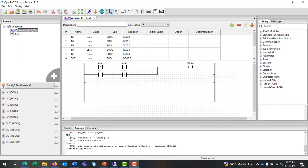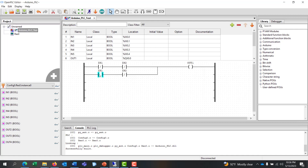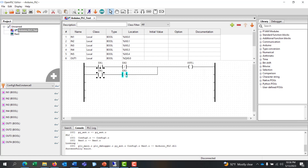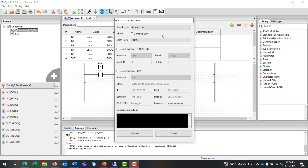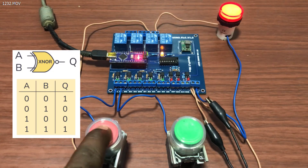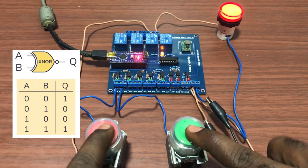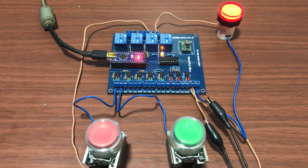We now move on and create our XNOR gate. We need to negate the input at the top side, and then clear the negation on all the inputs at the bottom rank. We click on compile and then upload into our board. First input: the output goes off. Second input: the output goes off. And then when both inputs are all on, the output remains on — fulfilling the truth table of an XNOR gate.